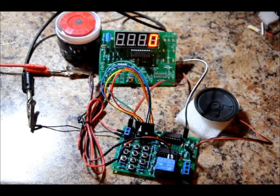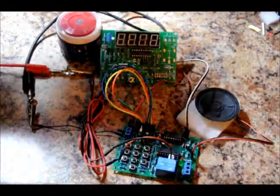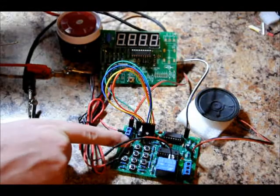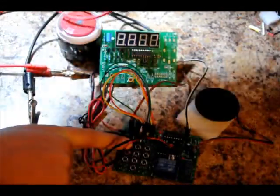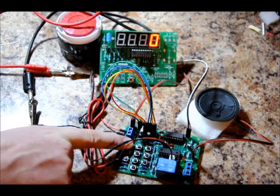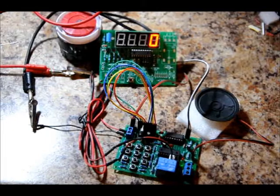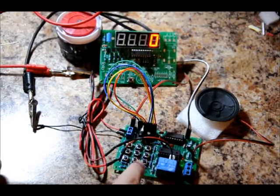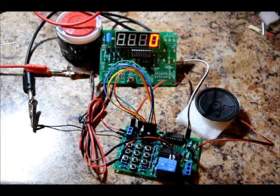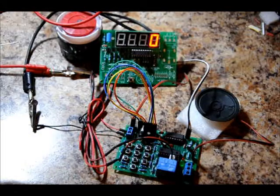Now, what you really want to do the first time you receive your board is apply power while holding down the S1 button. So hold that button down and apply power. Enter program mode, enter combination. So this will be the combination that is saved into EEPROM. So I'm going to do 5858. It's a 4-digit code. Any other code will give you an incorrect combination. It will cause the countdown timer to elapse at 20 times the speed in normal operation. So 5858.